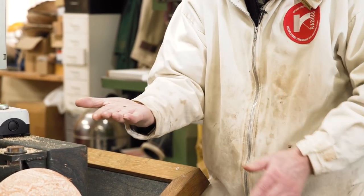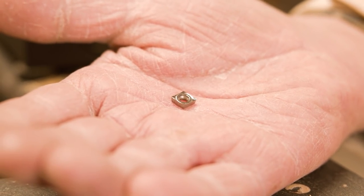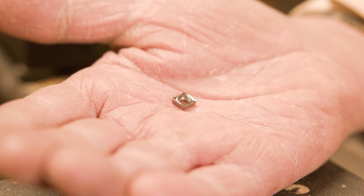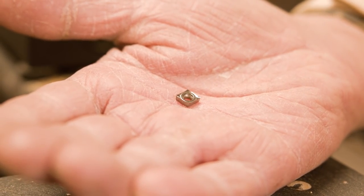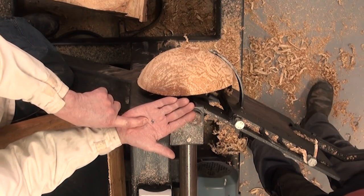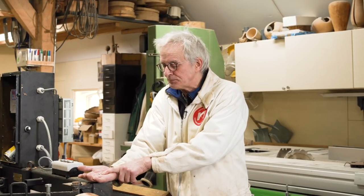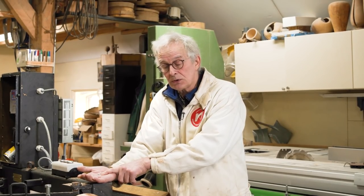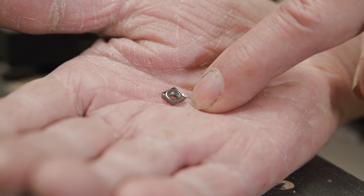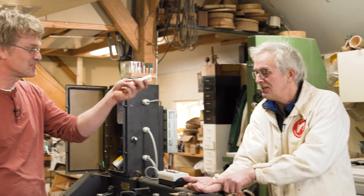They're for aluminium, right? Yes. They come from the metalworking world, where they were used on lathes and even on mills. And these ones are designed for cutting aluminium or aluminum, depending on which part of the world you live. And these are the smallest ones we have. If you want to know the exact code, it's CCGT06. Yes. CCGT06. I just wanted to say that.